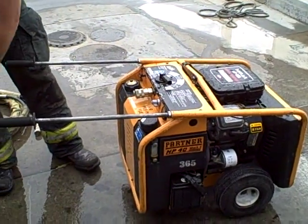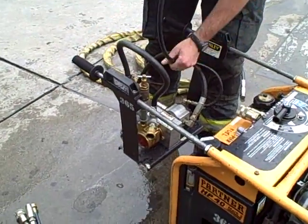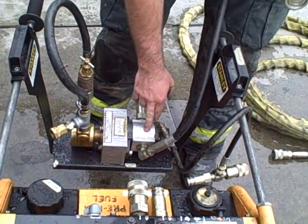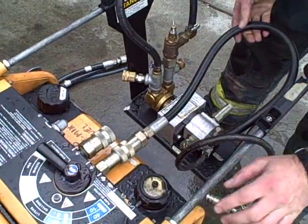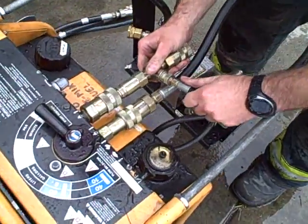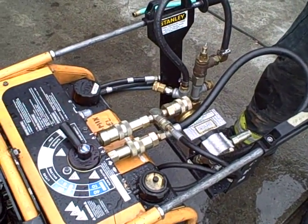The first thing we want to do is put the pump onto the power unit. The pressurization pump is made up of two sides. This is a hydraulic impeller that needs to be hooked up to the pressure side of our pump discharge. The pressure side is going to take the large diameter hose. The return needs to be hooked up and will use the lower diameter hose.